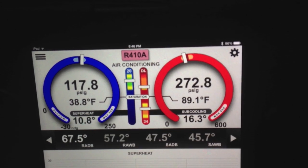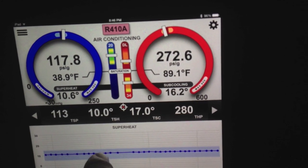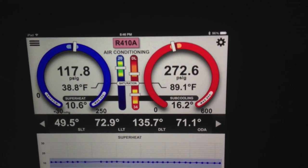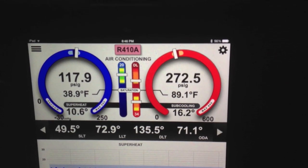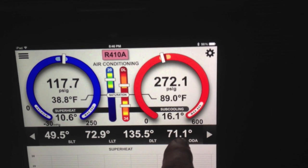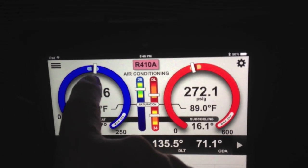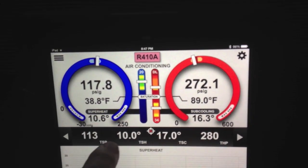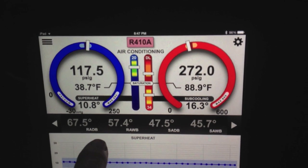Low discharge line temperature simply because we don't have a lot of load out here. Let's see what our outdoor air temperature is — our outdoor air is 71 degrees. It's not much warmer than that in the house. And you can see everything on the bottom here is coming in real time, making it very easy to troubleshoot. These indicators are driven off the outdoor air temperature, which drives the head pressure requirement. The low side is driven by the return air dry bulb and wet bulb.